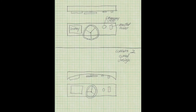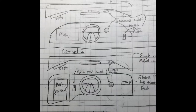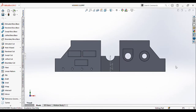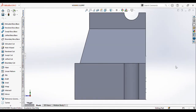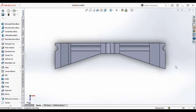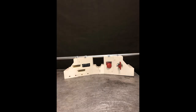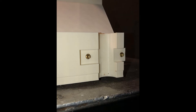For the dashboard, our goal was to improve upon the existing thin-plated example by creating a more stable and better-fitting design. After compiling ideas, we decided on a 3D-printed dashboard design that protrudes out towards the driver, divided into four sections for easy printing and adjusting. This design allows for support for the switches and displays, grooves to fit securely in the frame, and holes created for brass inserts to clamp to the frame tubing. It also allows for changes to be easily made in the future by printing off a new quarter instead of redoing the entire dashboard.